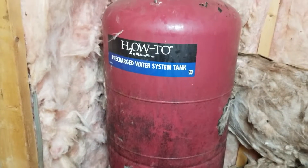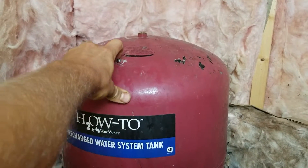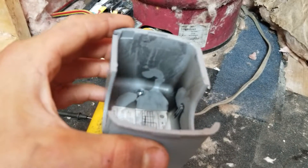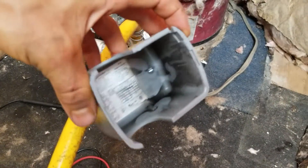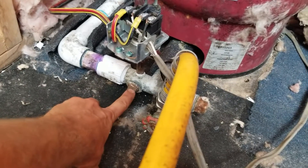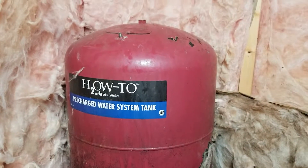Alright, so it's not looking good. This tank's waterlogged — I pressed on the top and water shot out. So that's bad. The contactor burned up; it's been going on-off, on-off, on-off, on-off, and yeah, it's burned up. There's no pressure relief valve. Any one of those might need a new T. Let's go hit the store and see what we can get to fix this thing.